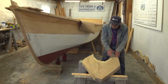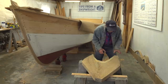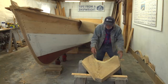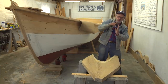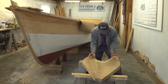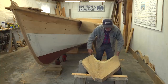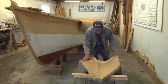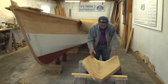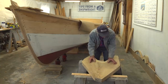Check this out — this is the piece we're cutting the breast hook out of right here. It's a white oak crook, but one side is the trunk of the tree and the other side is a branch. The branch is coming off the tree on a 60-degree angle. We're using the top, and it's got all kinds of nice figuring in it. It's cut pretty much exactly parallel to the medullary rays, so it's quartered on these two sides.